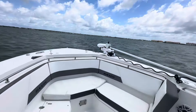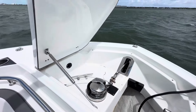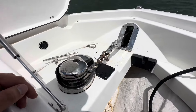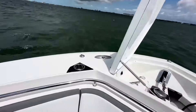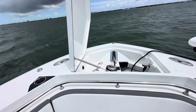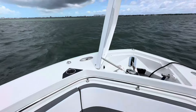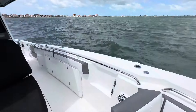First things first, I'm going to open my hatch. You want everything ready to go on the windlass — give it a test. Most boats are going to have an operation switch up here and an operation switch at the helm. Test it, check it, make sure it's good, make sure your clutch is tight. If that clutch isn't tight, the anchor's not going to come out. This anchor outfit is rigged with 25 feet of chain and about 600 feet of anchor line — I'll explain that later.